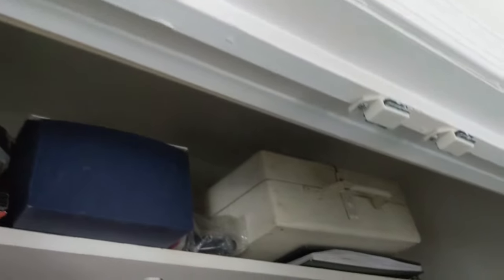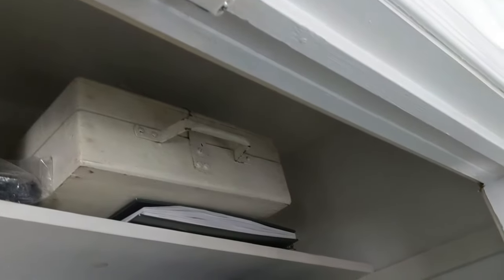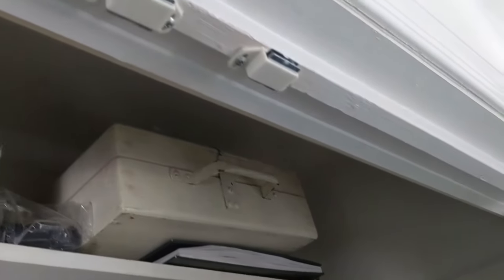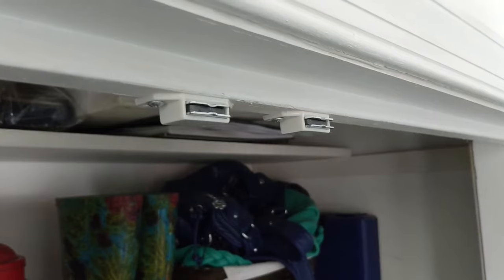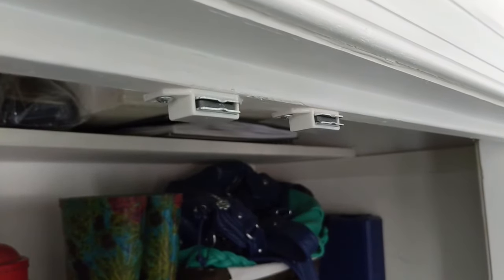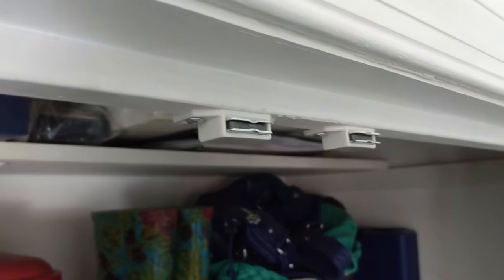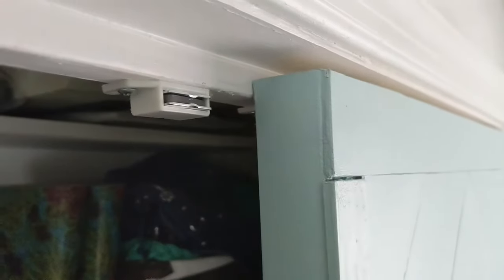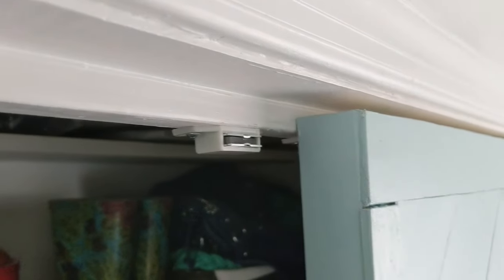I installed a small piece of wood along the top of the door frame to act as a stop bar to keep the doors from closing inward, and I also installed two magnetic catches. A lot of people use a ball catch for doors like this, but I read a tip that a magnetic catch is much easier to install and works better — and each one cost only about one dollar. A small piece of metal on the back of the door connects to the magnet when you close it, holding the door in place so it doesn't drift open on its own. The piece of wood at the top also keeps the doors in place.